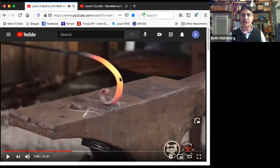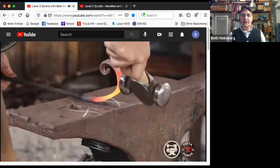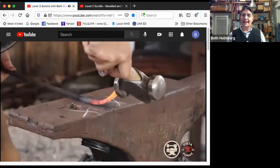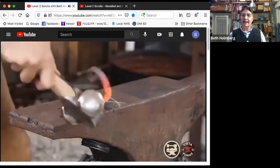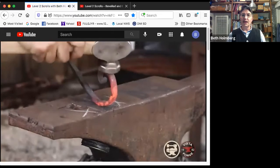Okay, there's my kink that I'm not happy about. We're coming around. It's very nice. And then it's tighter here and then a little flatter there. If I hit it here, that kink would get worse. I have to hit it right on the kink to get rid of it. Spot it early, figure it out, and pat on the butt. I've got my hand against my leg so that I can get a little pressure backwards. I'm looking at where I need to adjust it.